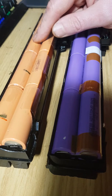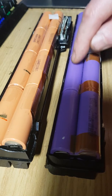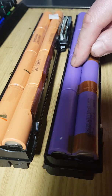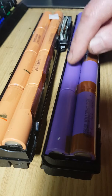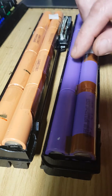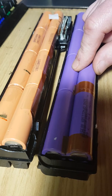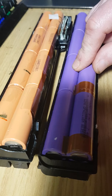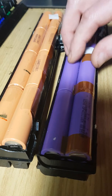This is a constant voltage of 4.3. So this circuit here is going to over-voltage a 4.2 volt charge cell, which is going to cause, or could, it doesn't mean it's going to do it every time, but it could result in these cells leaking, as in venting, catching fire, exploding, all sorts of dangerous effects.